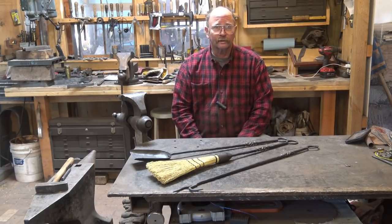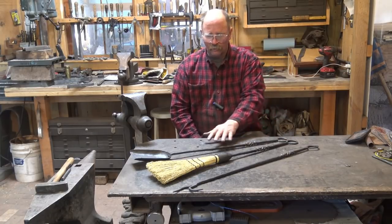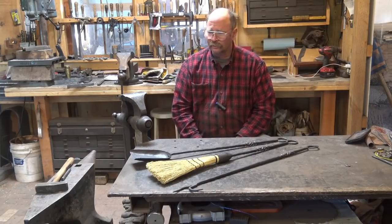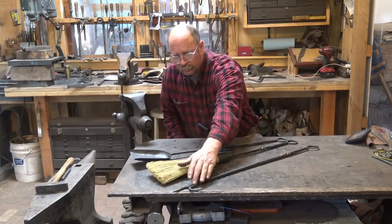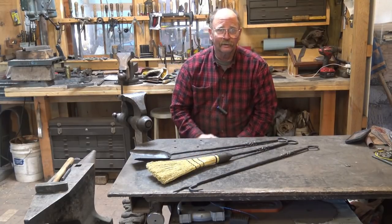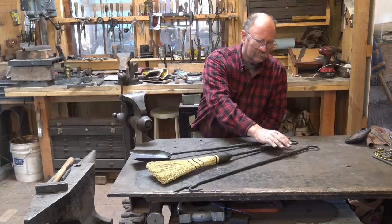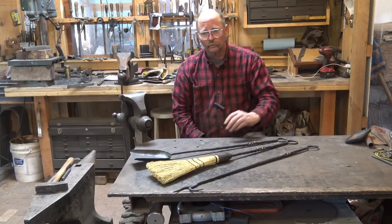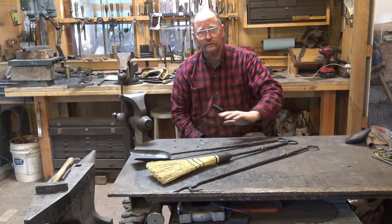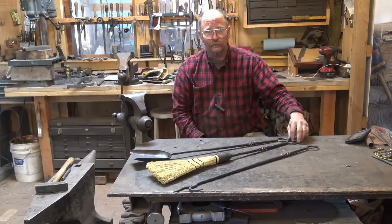Like I say, I think this is a great little project. It really involves a lot of good skills: creating a ring, creating shoulders, twists, drawing a taper, going from square to octagon, forging sheet metal, forging pipe, a little bit of a rivet, splitting on the poker — lots of skills in here. If you haven't watched the other two videos, go back and watch them. That's where we show how the handle was done, how the twist and the ring was all done. This is really out of context if you haven't watched that video, so I really encourage you to watch all three videos and stay tuned for the one on making the little rack that this will hang on.